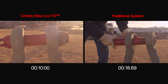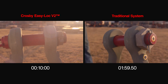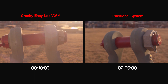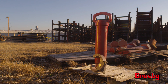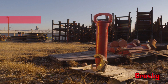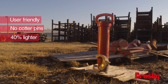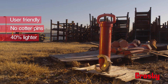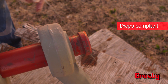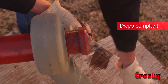Hands down, the EZ-Lock collar saves you time and money, with up to 90% faster installation and release times for bolt securement. But the new EZ-Lock V2 design doesn't just stop there. Tested by some of the top rigging contractors around the globe, the EZ-Lock V2 system is user-friendly. No cotter pins are required. EZ-Lock, on average, is nearly 40% lighter than traditional nuts. No tools are required, and it provides convenient tether points to secure the collar to the bow in an effort to help prevent the collar from being dropped when performing elevated lifts.